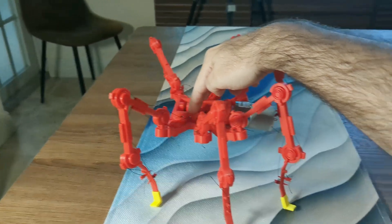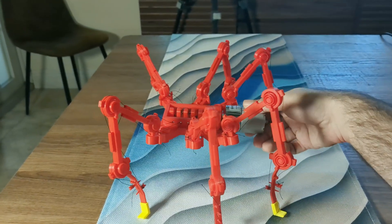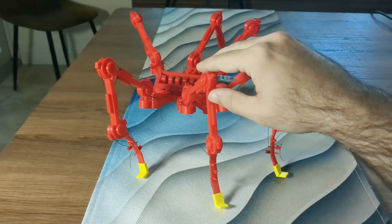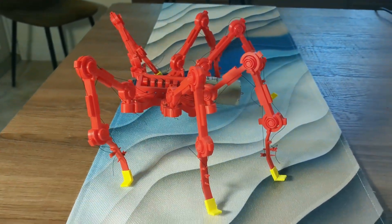To fight gravity, I made caps to make sure the joints don't flex in the wrong direction. I fixed the thread tension so those muscles of the leg are properly tightened for the whole range of movement, and I gave the legs little booties to make sure the foot isn't sliding around. So with that, let's dive deeper into the joint caps.